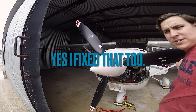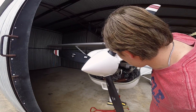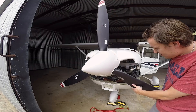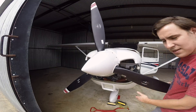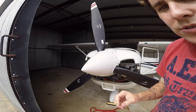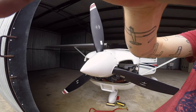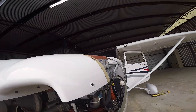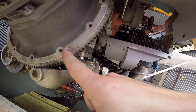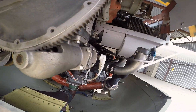It's very important when timing your magnetos that you actually fire the impulse coupling — if you listen, you'll hear them go off. That loud click was the impulse couplings. The other click you were hearing was actually the starter engaged, which is not supposed to be — this little gear right here. On this one I have my timing marks: top center, 20, 23, and 25.